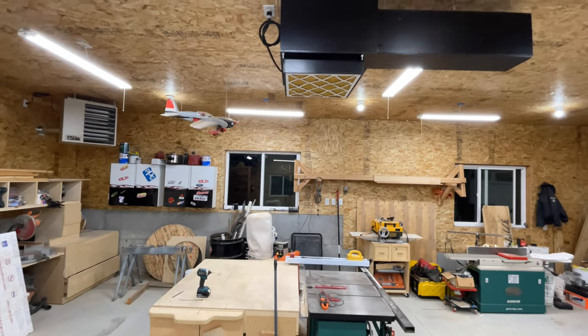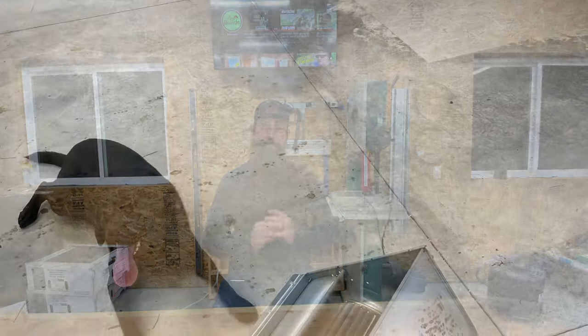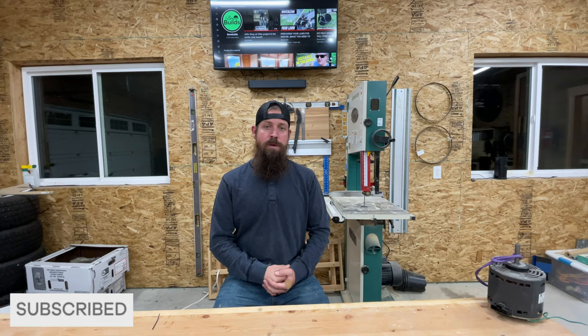That's my shop air filtration system. I built it for a couple of reasons — one being pretty obvious: I wanted to filter the air in my shop while I'm doing projects, and the other is to circulate more air. Now that temperatures are starting to drop, I'll be running my shop heater a lot more, so this will help cycle that warm air around. I was able to pick up this blower motor for free from a buddy in the HVAC trade, so aside from buying one sheet of half-inch plywood and replacing a motor that got burned up, it was relatively cheap to build. I'm currently running a 20 by 20 by 2-inch filter that seems to be working awesome. The motor itself is 3-speed so I'm still messing around with what speed I want to run it on, but I think the low speed is going to be the hot ticket — it moves enough air and it's not as noisy. Make sure you're subscribed, like this video, and I'll catch you on the next one.